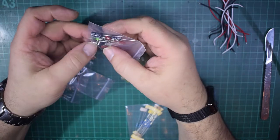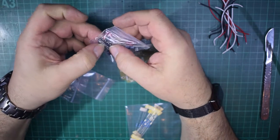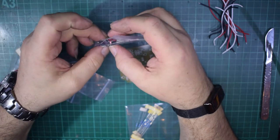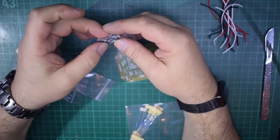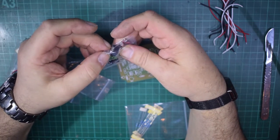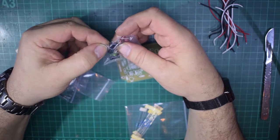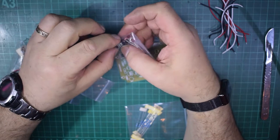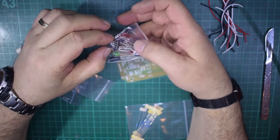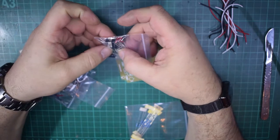What I have noticed is the op amp socket is not your usual cheap and cheerful, but it's actually one with turned pins. So, a better quality socket. Whether the 4558 is the best op amp to use, I don't know. You can experiment because it's in a socket, and if you don't like the sound of that particular op amp, change it for something else. There's nothing stopping you doing that.